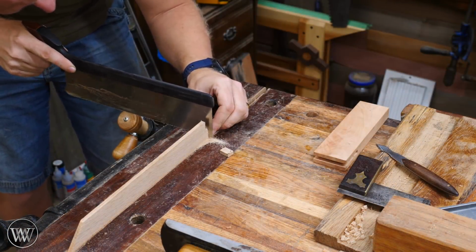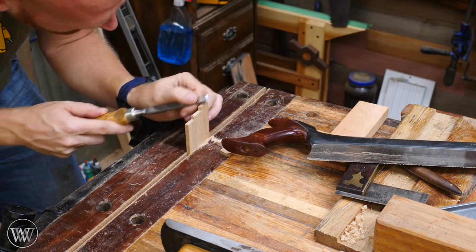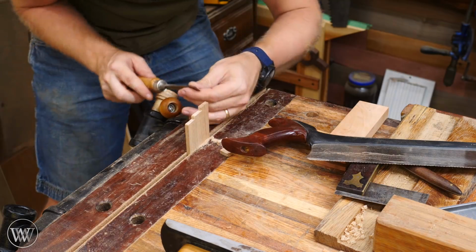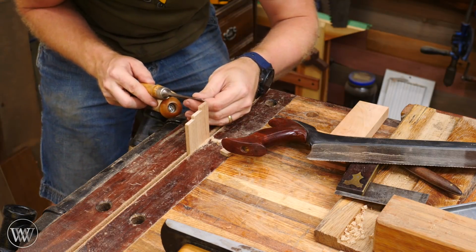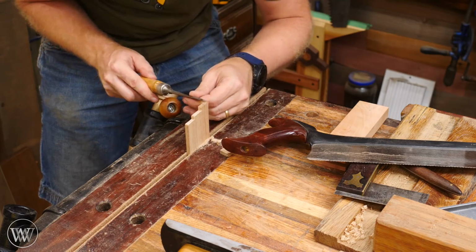This will create a 1/4 inch notch, a 1/2 inch notch, and a 3/4 inch notch away from the post on the tri-square. Makes it so you can kind of use it as a marking gauge, and I'll show you what I'm talking about towards the end of the video.